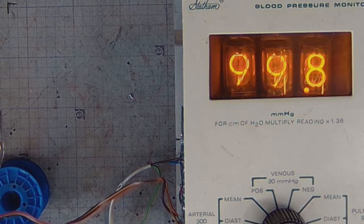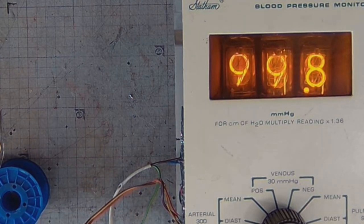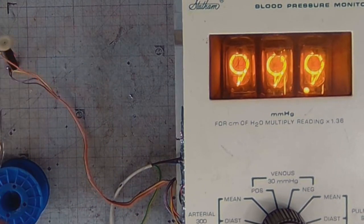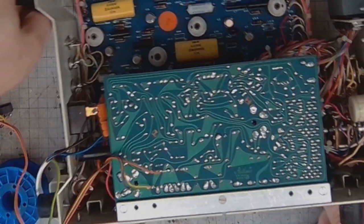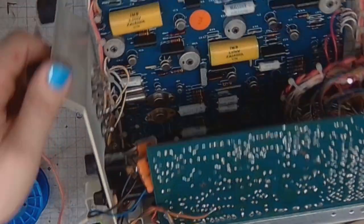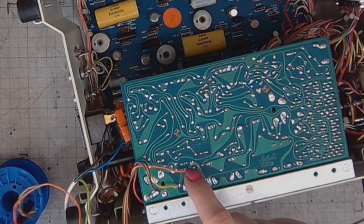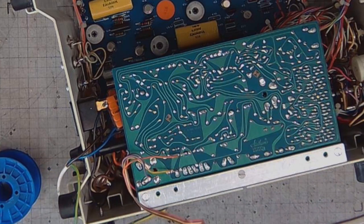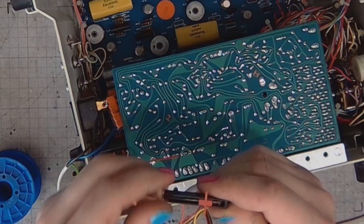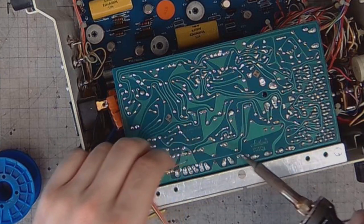It is also interesting that after I measured the voltage, it seems like I was wrong. Like I might have made a mistake. Yes, I made a mistake. I just jumbled the positive that should be here. I thought this was the positive. Shenanigans. So, turning the pot all the way down. Moving the false positive to the true positive.